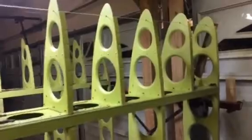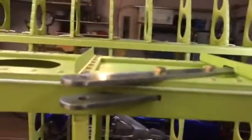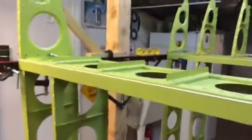Part of my day was the shop visit, and the rest of it I spent putting these nose ribs in right here. This is the left wing. Nose ribs — I got all the way up to number 12. Number 11 needs to be fitted around the wing strut straps, so I need to do that. I also have to fit the spacer bar and the 90-degree attach angle here at rib station number 9 for this wing, and then finish putting on the nose ribs all the way down. Should be a piece of cake.